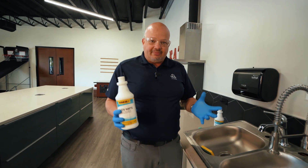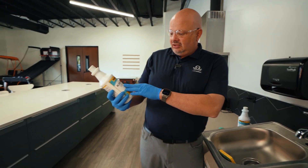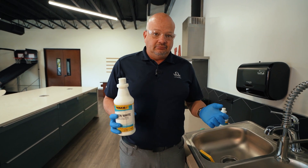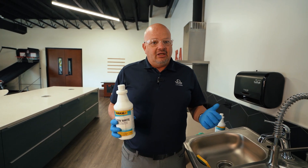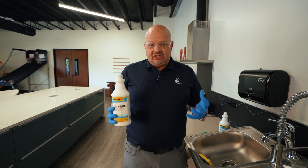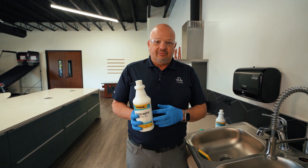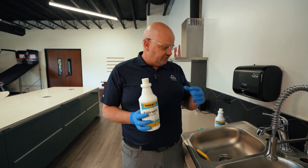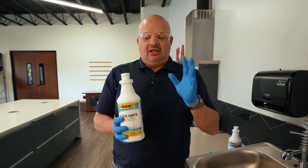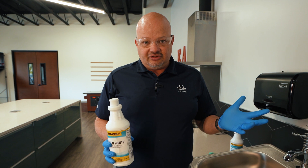I get a lot of questions about if hydrochloric acid is so bad, what do we use it for? Why does it say emulsifying bowl cleaner? It's exactly that — toilet bowls do not have steel in them. We don't use it all the time, but if we have a building that's been vacant for a while, or the stains are really stubborn, we're going to use this. It's not something I use on a daily basis because of the dangers it poses to chrome and stainless steel. So in short: hydrochloric acid is for the insides of toilets and urinals.